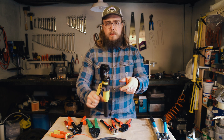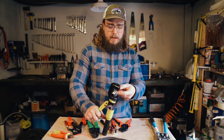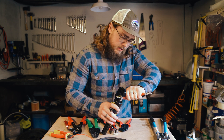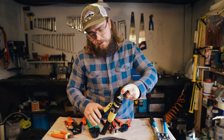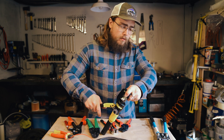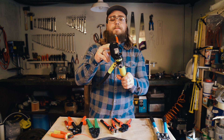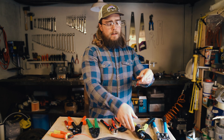I take the crimping tool and push the connector pretty much slap bang in the middle — I already have the right dies in for this size connector. I push it in until the crimping tool is holding it, then twist the wire in as much as possible. I like to put my finger over the top of the jaw so I can pull the wire in, then rest the bottom of the tool on the workbench and pump it. Once you get close to the end it'll hold the wire and you do the last bits. I go until I can't go anymore — that's when the dies have hit and in theory that is a really solid crimp.